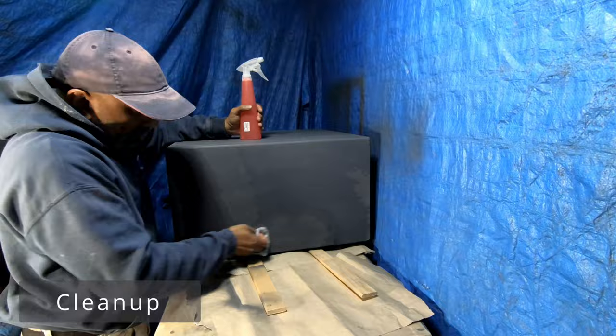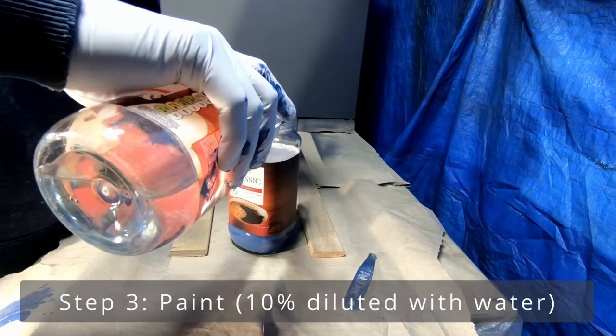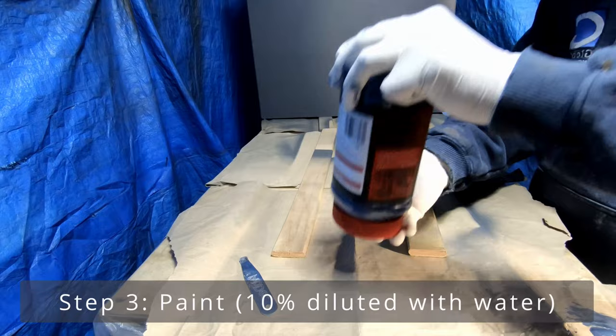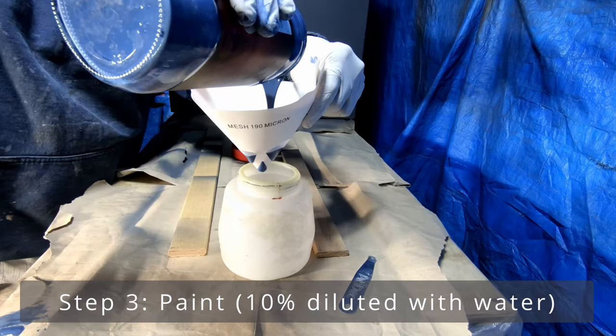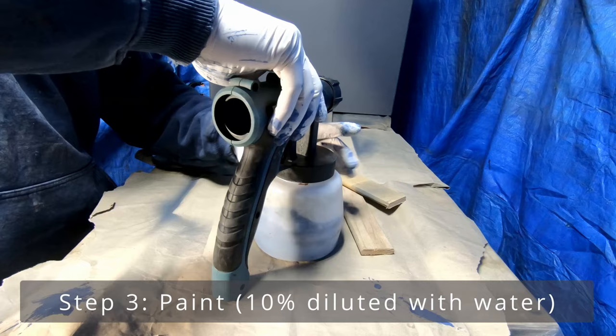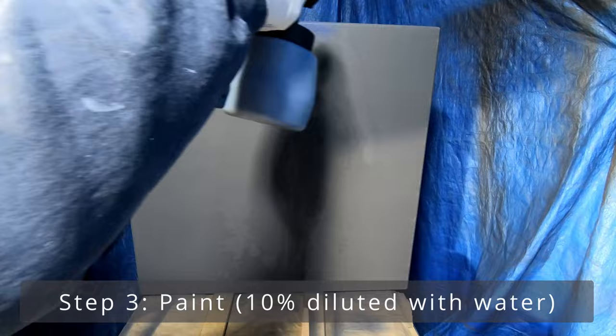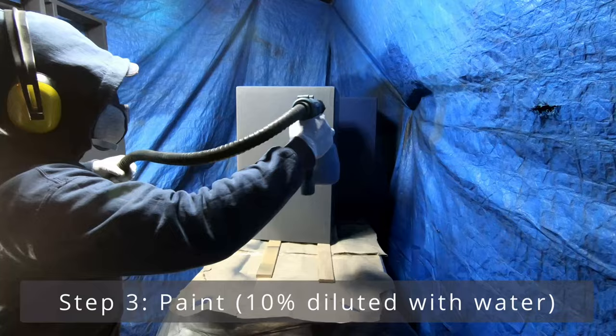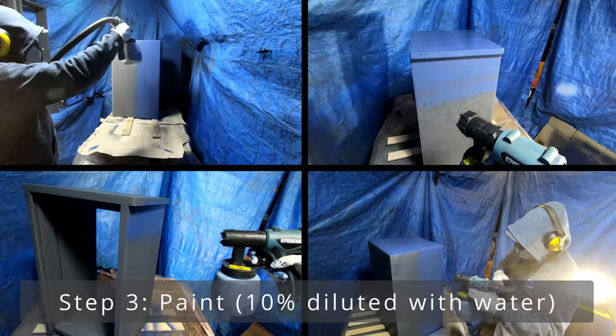Next is the paint. I poured the paint into a jar and diluted it with around 10% of water. The aim is to reduce the viscosity of the paint so that we can spray it freely through the HVLP sprayer. Keep shaking the paint until it mixes thoroughly with water — and when you think it's enough, keep shaking it a bit more. To remove any paint sediments, filter the mixture through a micron mesh — I'll leave an affiliate link below if you're interested. Just to reiterate, I'm using the same products I had used while hand brushing. One tip while spraying is not to concentrate your nozzle at any given point — keep moving it in an even pattern, and if you miss a spot, you can always get it back in the next round of spraying.